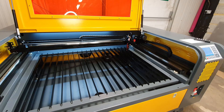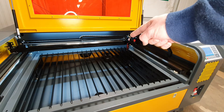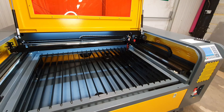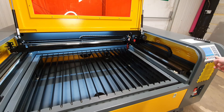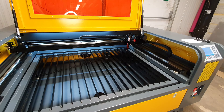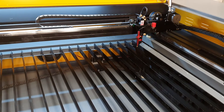Let's take a look inside the machine. We've got the laser head over here — this model is an upgraded model compared to most laser cutters. If you look at the laser head you'll see a large gear wheel that lets the stepper motors have more precise control, which you need on a machine this large. The bed has blades fitted to it — I did have to take the Dremel to the cutouts to help get those blades in, as the powder coating was a little too thick. The bed is powered and we can raise and lower it from the control panel. The head also has an autofocus module fitted to it, which you'll see in action in a moment.